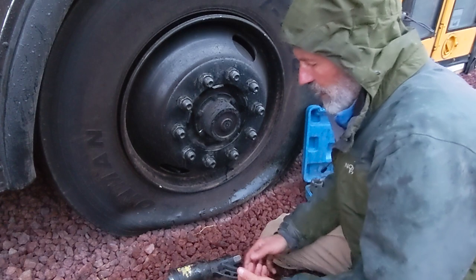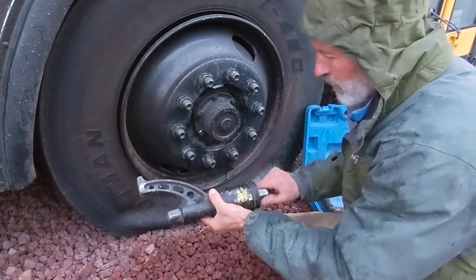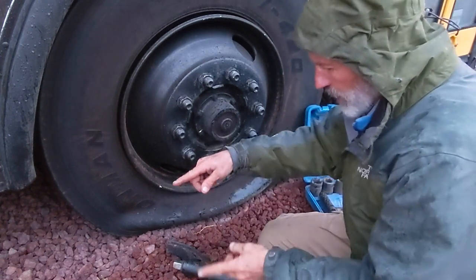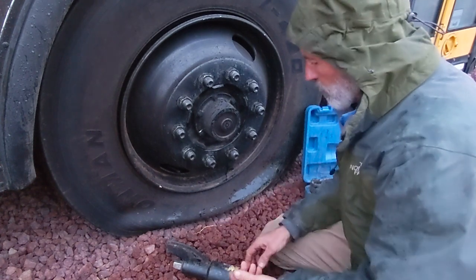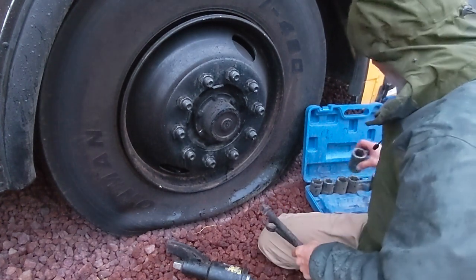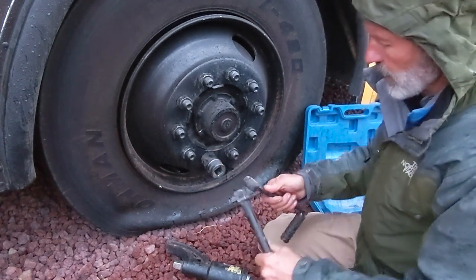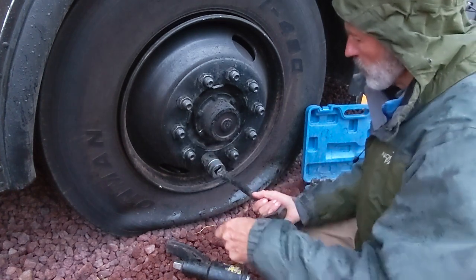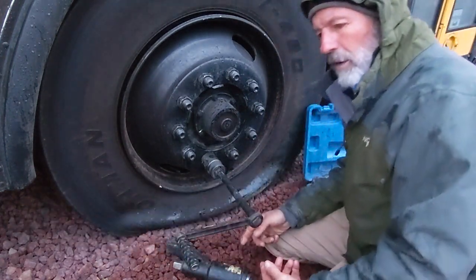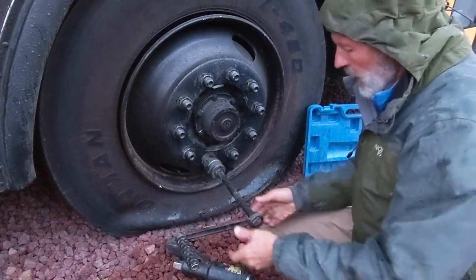basically is, it's got gears in it, and I think this takes like 64 turns of this end to turn this side one revolution. So you're getting a leverage advantage there. We had little torque multipliers with a handle I could put inside on the alternator bolts in the wind turbine. But this is a different version of it, and it just works really well. So for example, if I were just to put this on here, I've had bolts, nuts, lug nuts that, even with a 3-foot cheater bar, I've had some with a 6-foot pipe on there, and they were just tight and hard to get off.